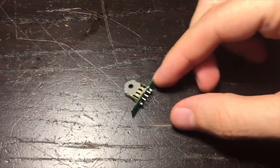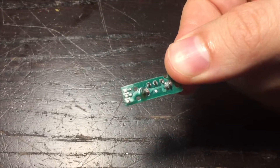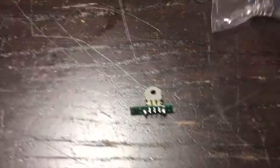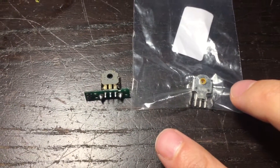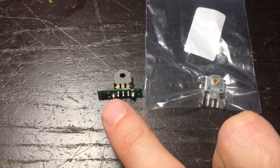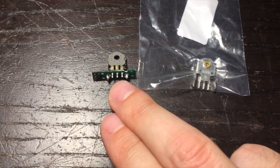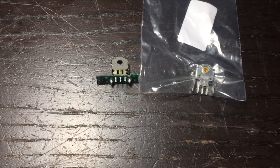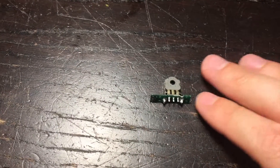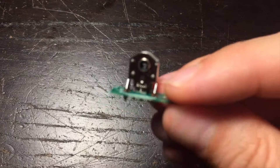Now you'll leave that behind — all the attention is going to go to this small board. What you need to do is remove this encoder from the PCB. If we look at the new one, you can see that these two side pins bend out like a clip — when you put the new one onto this PCB it will clip into it. That tells you that if you desolder all of this, the encoder will not simply fall out; you need to pull it out. So what I'm going to tell you here is: just cut that encoder. Get rid of it completely. Don't worry about saving it — it's a piece of junk straight from the factory.